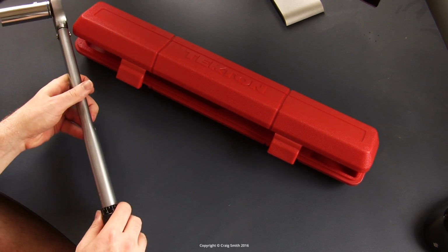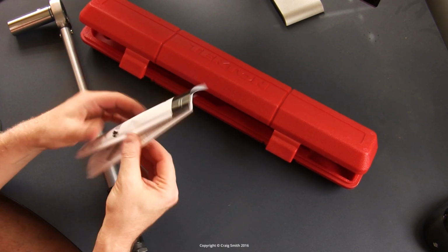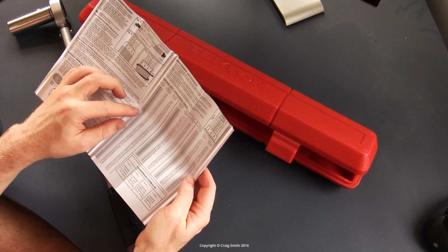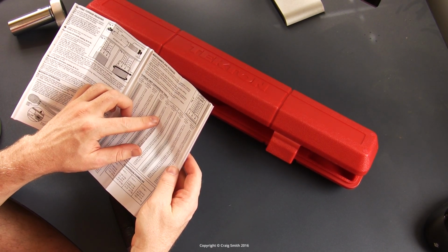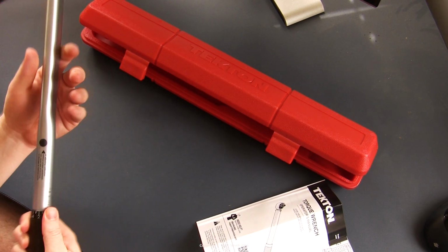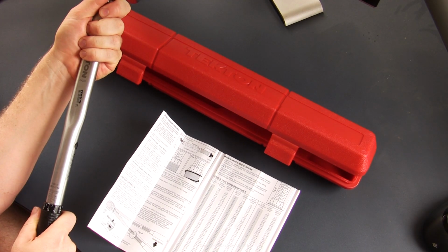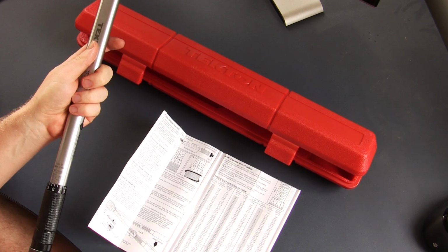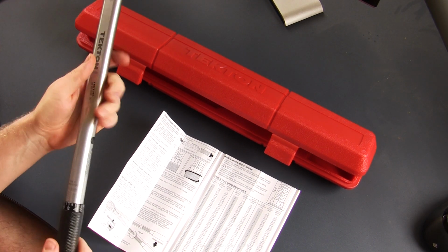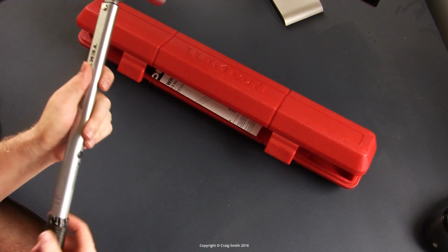Now, alternatively, you could firstly convert 90 Newton meters to foot-pounds. And this is where this conversion table comes in handy. So we find Newton meters, if we wanted 90, that would be 66.38 foot-pounds. And then you just go to the foot-pound scale. So then you would just dial it up to 60, and then put the micrometer to 6.4 there, and you're done. And of course that's quite a bit easier. So for anybody who needs to work exclusively on metric systems, bear that in mind.